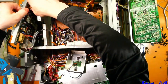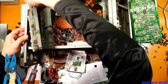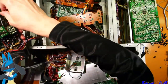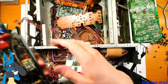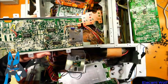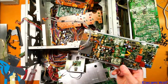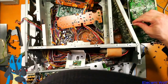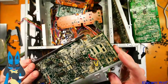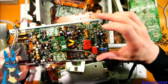It's got all its own wires on the bottom holding it in place. I've unleashed a mighty stink from that. We'll unplug the plugs. So that will be the HD audio — FM audio. It's got surface mount stuff, and it's a double-sided through-hole plated board. Rotting caps all over it corroding the board. There are some pretty decent film caps too — yeah, it's corroding. It's got satellite boards labelled 'Audio Emphasis' with codes V-J-B.